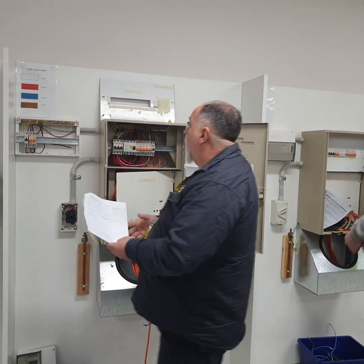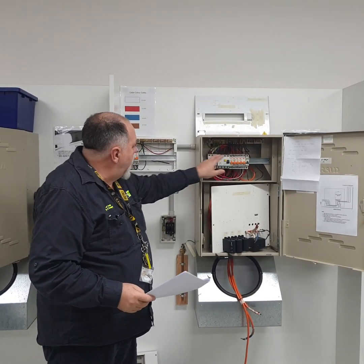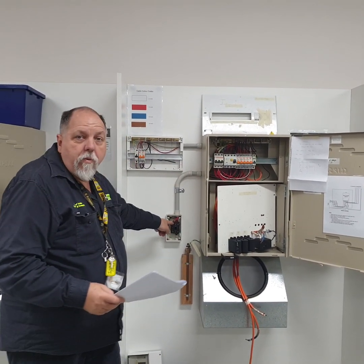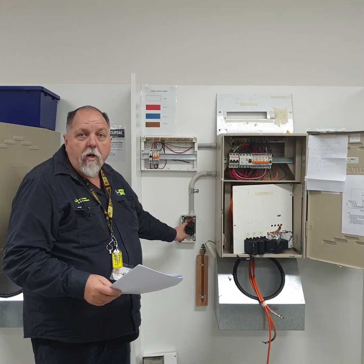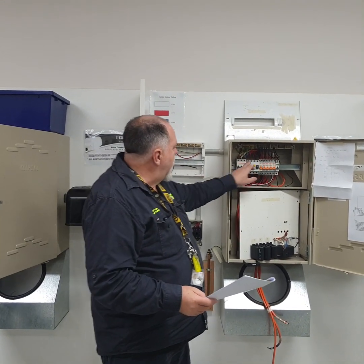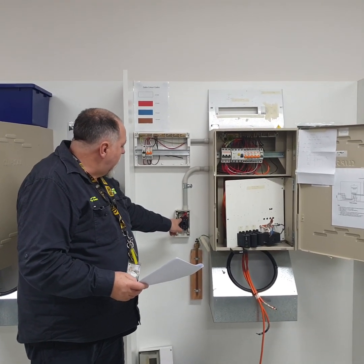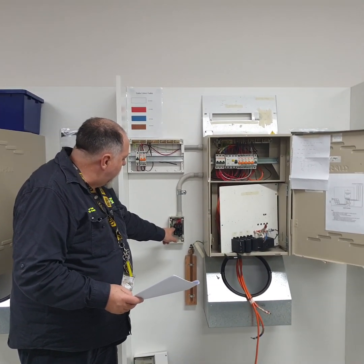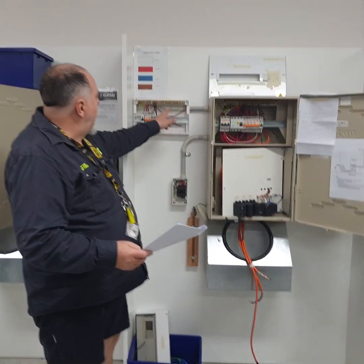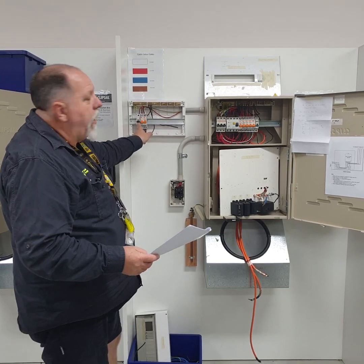All right. We come over here. The wires from the top of the main RCD need to be run to the top of the isolator. All right. You can't leave short tails for it. Okay. So you bring your tails out. That's the only thing on the 3-phase. The cables must come to the top of the isolator here. The earth and the neutral is done as well. Over here, he's run over here. The top, this main switch, this can be an isolator.